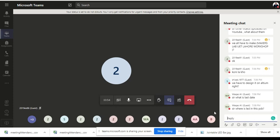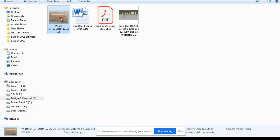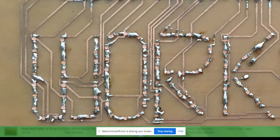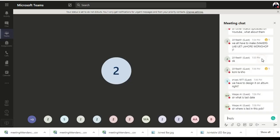Soldering SMD LEDs is very difficult. In last year's project the soldering was pathetic — blobs everywhere. I will show you how to do it properly; it takes practice. Also, last year the students — from the 2018/A19 group — connected the anode and cathode in the wrong direction. This is very important: if you connect the LED diode in the wrong direction it will never work.